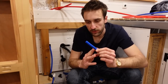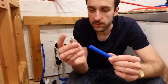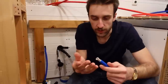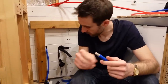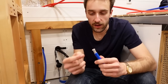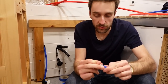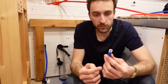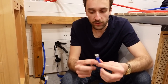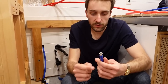After cutting the pipe to join everything together, we're also using the little plastic inserts you can buy with the Speedfit system. When you cut the pipe there might be slightly sharper bits that can damage the seals inside the connector, so the insert stops that. It also keeps the tube really round and strengthens it, which together hopefully means it won't leak. It's probably more important on the hot side where temperature changes occur, but they recommend using them on the cold side too.